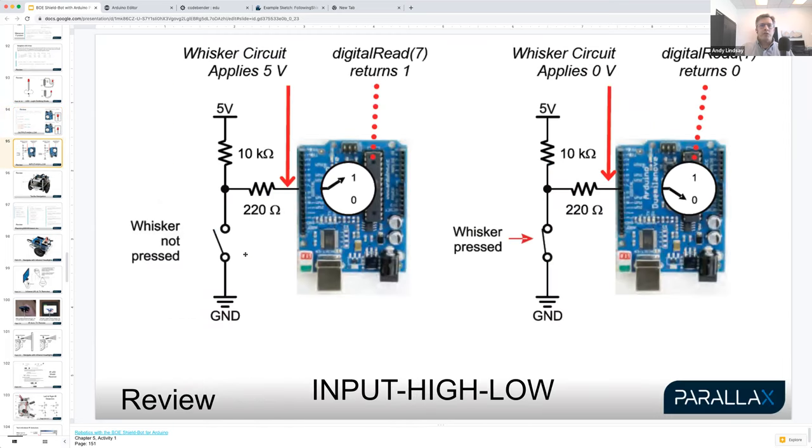There's an inverse of that, which is checking a pin. Now, when you're checking an Arduino pin or socket to figure out whether 5 volts or 0 volts is applied, it's no longer an output. It's not sending 5 volts. It's not sending 0 volts. What it's doing is checking to see whether the voltage is above 2.2 volts or below 1.1 volt. Or I'm sorry, whoopsie. It's above, I believe, 2/3 of 5 volts, whatever that is. I'm going to have to look that up. I apologize, I was thinking about a different microcontroller. At any rate, there's a high signal.